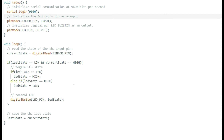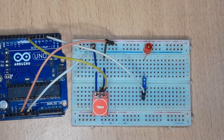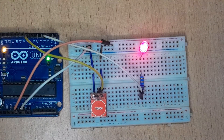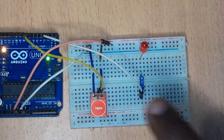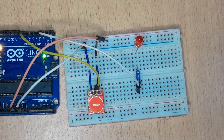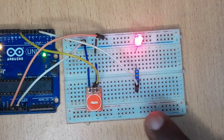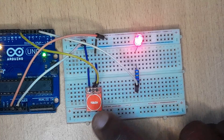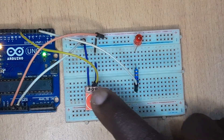Let's upload this code to Arduino and see how it works. Now I've finished uploading the code to the Arduino board. When I touch the sensor, the LED goes on and stays on until I touch again — that is the toggle mode. Note that the sensor itself is actually in direct mode because configuration pins A and B are both open. But using the Arduino microcontroller, I've implemented toggle mode in software. I'll leave it to you to try out other operation modes. Hope you've enjoyed this tutorial and learned something new. Don't forget to subscribe to my channel and watch my other tutorials. Thanks for watching.